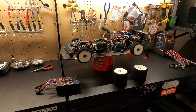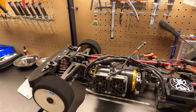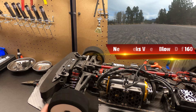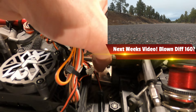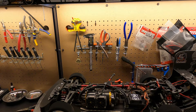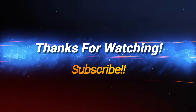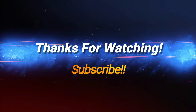Well, that's the end of this video. I hope there was some good information and it helped some of you guys out. I'm going to go ahead and start figuring out what's wrong with my speed run car — last time I was out I blew the front differential. I'm probably going to open it up and order the diff housings I want with the bigger input bearings so I quit blowing my input bearings, then order new differential gears for the front and back. Just replace everything and we should be able to hit 160, no problem. If you guys are a new watcher, hit that subscribe button and click the bell so you don't miss any new videos. Thanks for watching, see you next time!